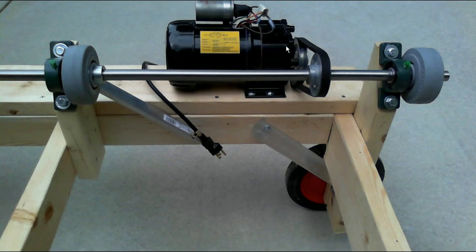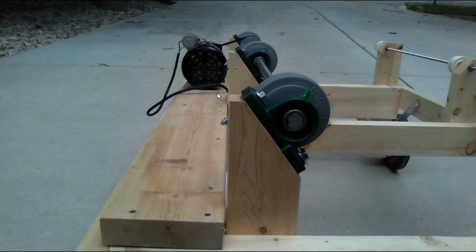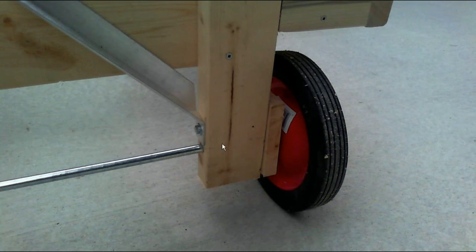Here we're mounting the electric motor, pulley, and belts. The drive pulley is a little bit too big for the motor to be mounted directly to the 2x6, so I used a skill saw to create a small recess to provide more room for the pulley. You can see the 5-degree angle because I've mounted the front wheels, so I had to cut the length a little shorter to provide that 5 degrees. I then used the big gator tool to drill the hole through the 2x4 for the wheel axle shaft.